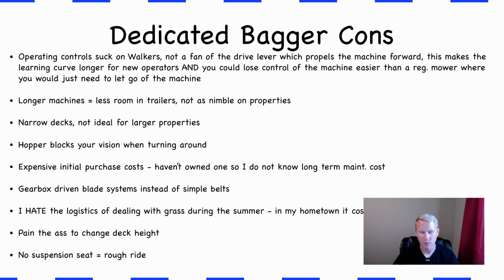In my opinion, with the numbers we could run, it basically paid off to spend the extra 2, 3, 5 minutes or whatever on a typical residential to blow out the landscape beds and blow off the hard surfaces, instead of wearing out more equipment because you're running your baggers. If you're running a traditional zero turn, you're running the baggers a lot longer. You're putting wear and tear on those, it takes away their operating life, and you have to deal with the logistics, all that. The numbers didn't make sense to bag every single property. In some areas, you may be able to dump for free, and maybe it does work. That's just for you guys to weigh out with your own businesses.